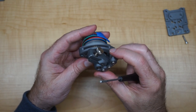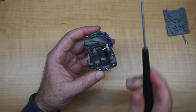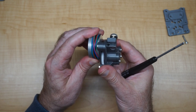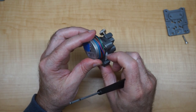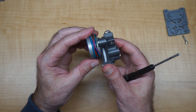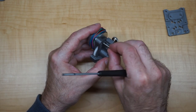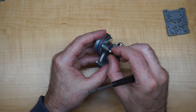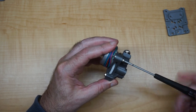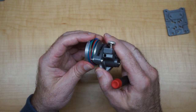And once you get the bottom part of the motor on, you'll notice that the top hole here is slotted. So this allows you to basically adjust the motor so that the gear is meshing correctly with the plastic drive gear here. And you can feel that there is a little bit of play that you can adjust. So I can push this down so that I've got a good, secure position on the motor, and when you drive the screw through, it tightens up on the back of the motor and won't have any play